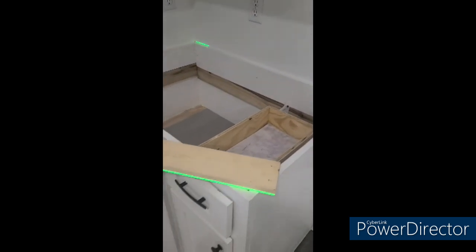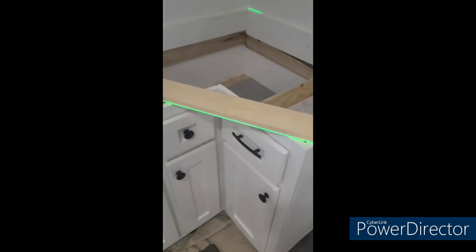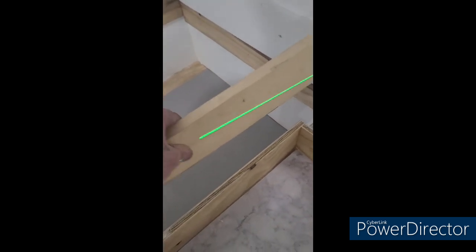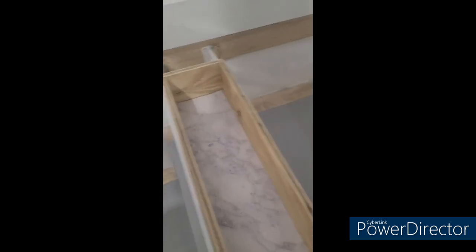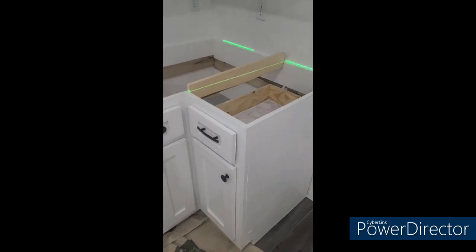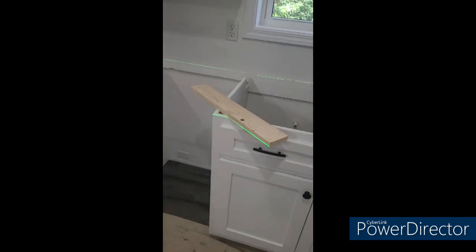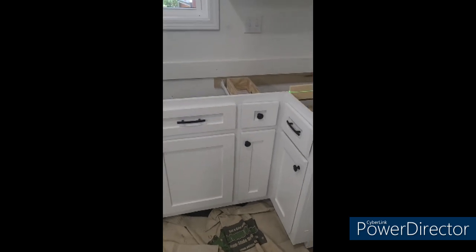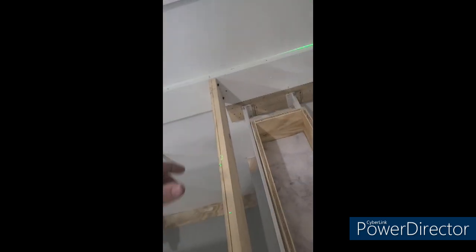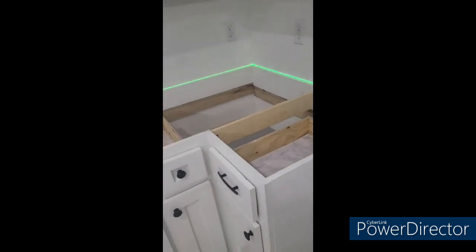These cabinets are level and they're actually pretty sturdy. You've seen me do this on the floor and they move about four inches, but we're going to go ahead and put a couple of braces in here just for safety. The braces are in now — there's zero play in these now, and it just made good cabinets better. If you're doing an install and it's open like this: if it's quartz, you can put it on there and not really worry about the supports, but if it's granite, I would highly recommend putting some type of support in there. Nothing to it — pretty simple.